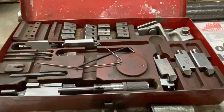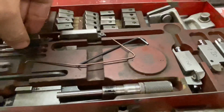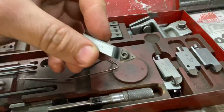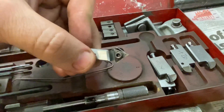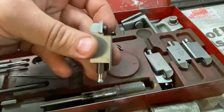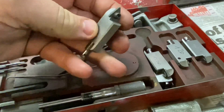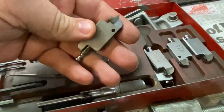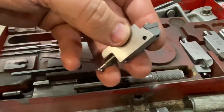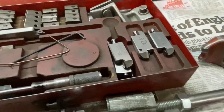Some of the other modifications include the addition of another cutting cartridge for chamfering the cylinder bores, which is very helpful. All these cartridges come from the United States — Beam Equipment is where I bought these from. They do an excellent range of aftermarket parts for upgrading and maintaining your Van Norman machine.